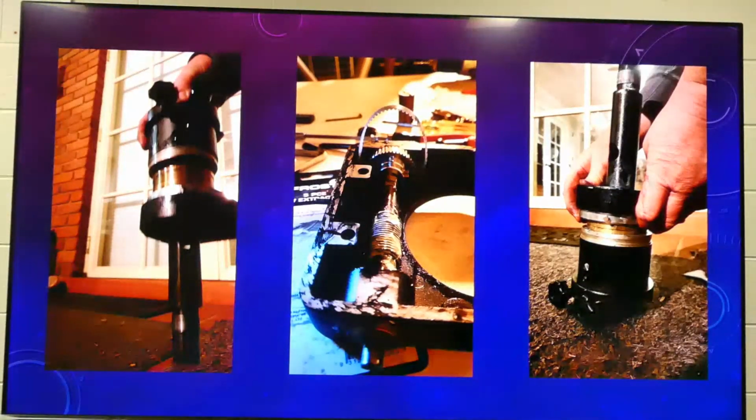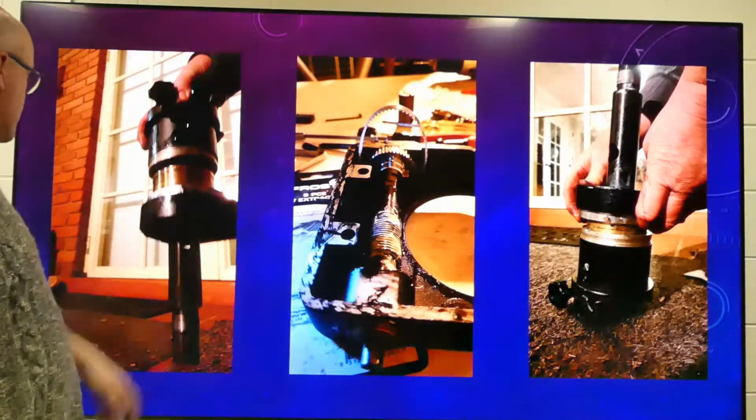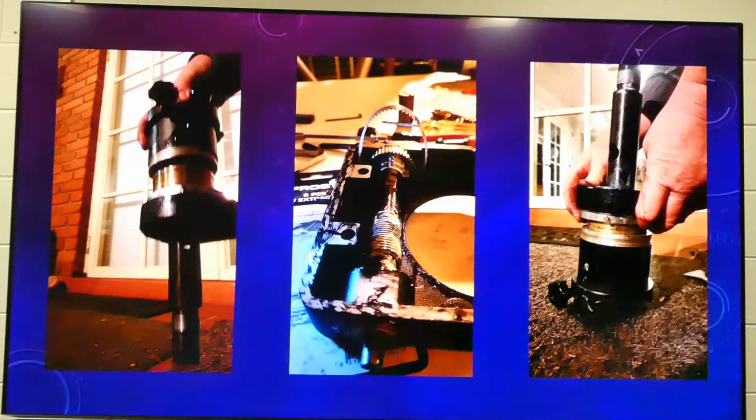Yeah, so this is the bit I was telling you about, trying to get this out. It took quite a bit of force. So basically, I ended up finding a soft mat and just slowly banging it until it fell out. But I've since found a better method, and that was just to get my workbench, which has a grip in it, and jam it into the workbench and then slowly wriggle it out like that. So that's probably a less potentially destructive method.